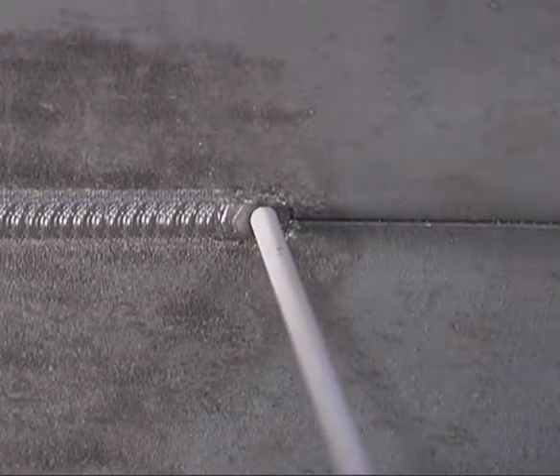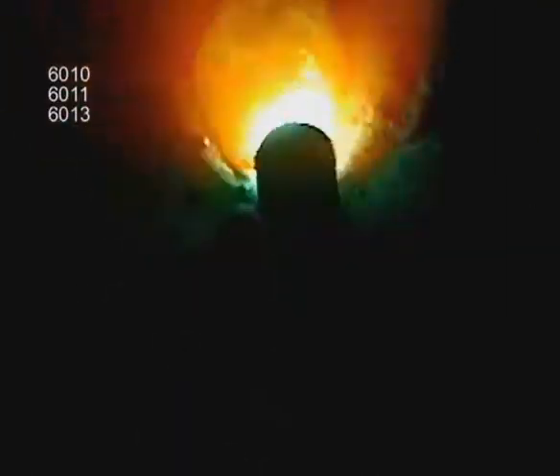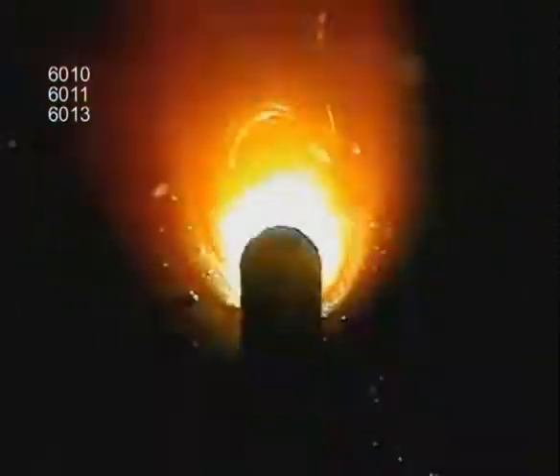On a horizontal, hold the rod nearly perpendicular to the weld. Watch the puddle. With 6010 or 6011, adjust the travel speed to let the puddle spread out without overheating the metal. Watch the top side to avoid undercutting. With 6013 or 7018, try running straight without any rod movement, maintaining a uniform arc gap and travel speed. If you can position the joint, butt welds on one-eighth metal are easier welded vertical down. One-eighth metal is fairly thin for stick rod, so use some practice metal to figure out the amperage and adjust your travel speed.